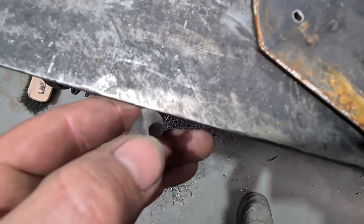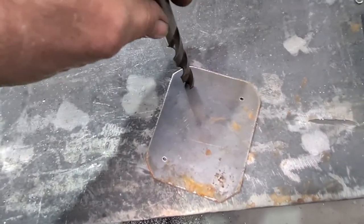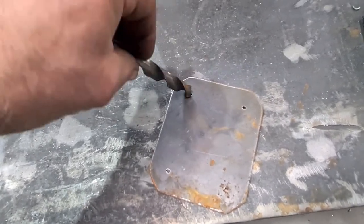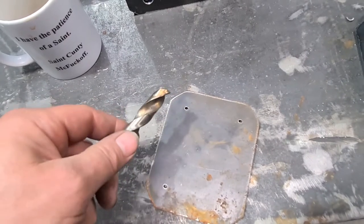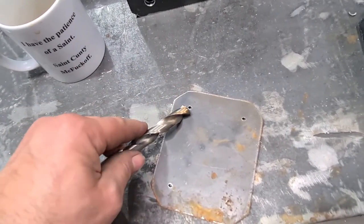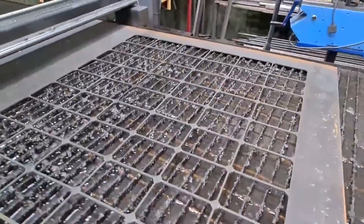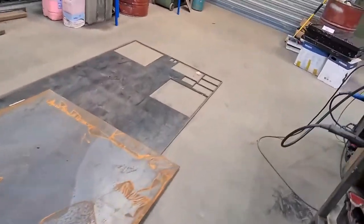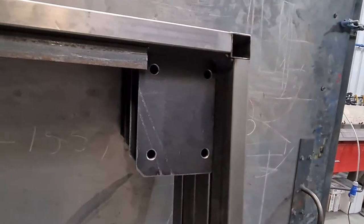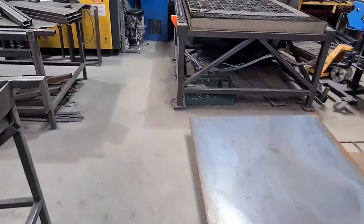So what you're aiming to do is come in further on your drill bit — closer — so you've got a lot of meat between your edge and the center of your flute. Although that pierce is a bit small, it's still going to hit the meatier part of the cutting edge. That way, all that happens is that the hard part of the hole — and believe me it is quite hard — won't chip out the outside edge of your drill bit, because at that point you're into the softer, real mild steel, the unhardened stuff. The meat of the cutting edge can take more of a bashing with harder material than the very edge. We cut out lots of plates all the time — wheel plates, little dollies like this — and you can see it's all got to look quite nice and tidy.